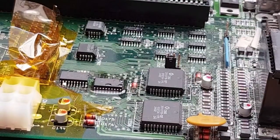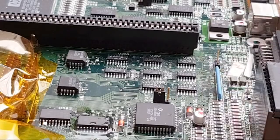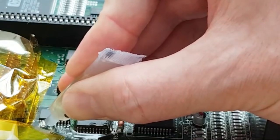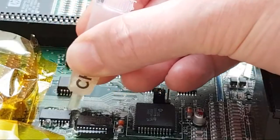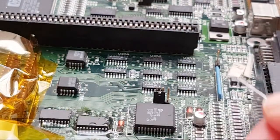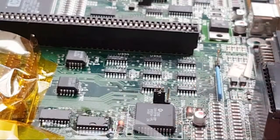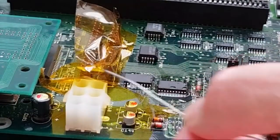I'm just going to move those old BCT chips out of the way. Oh, it's exciting. Is it going to be any different? I bet it's not. I bet I'm left with a GAL issue somewhere or something for one reason or another. You're able to trick it into that short polling thing there when you've got a GAL issue, when one of the pins is perhaps not as strong as it should be. Can you see those chips now? Yeah, sorry, I moved around a little bit there, didn't I?